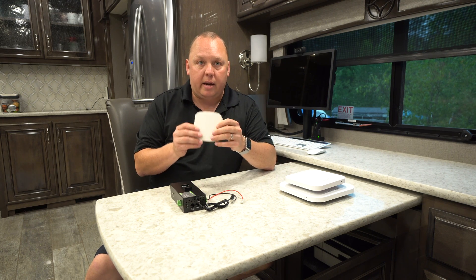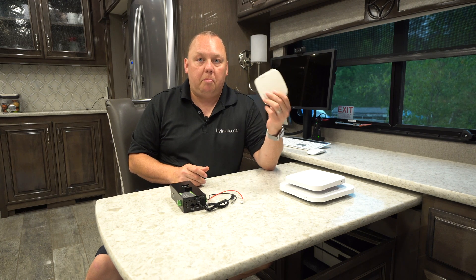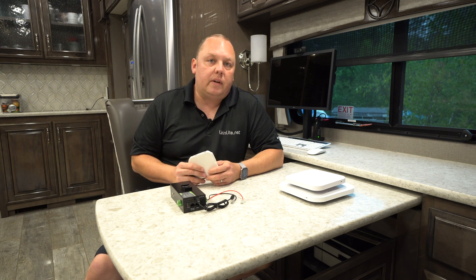To give you some backstory on PoE: a lot of the Peplink devices that we sell don't have PoE output, but most of the access points in the Peplink lineup — if you're looking to add additional wireless coverage — support being powered over Ethernet. So we thought, maybe we should just get PoE injectors or PoE switches to provide power to these. The problem with those devices is that they don't run on 12 volts. They almost all require a large AC adapter that down-converts to 56 volts, so you have to have your inverter running all the time for them to function. That's just power-inefficient — you're taking 12 volts from your house batteries, up-converting through your inverter to 120 volts, and then down-converting it back to run that switch at DC power again.